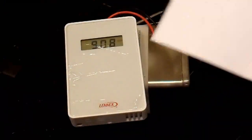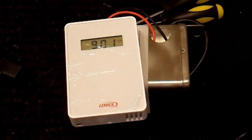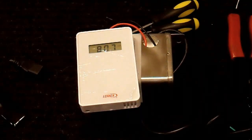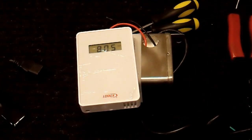Most of these are in the range of 0 to 2,000 ppm. And I'm really curious where my house is going to stand, because as I mentioned, it's a pretty well-sealed house. Well, it's been more than a minute, and you can see that it's 800. Now, there's only one person in this house, and I've been gone most of the day. I've also run my dryer for a few hours today, so this is about as well-ventilated as this place gets. 800 is pretty high.